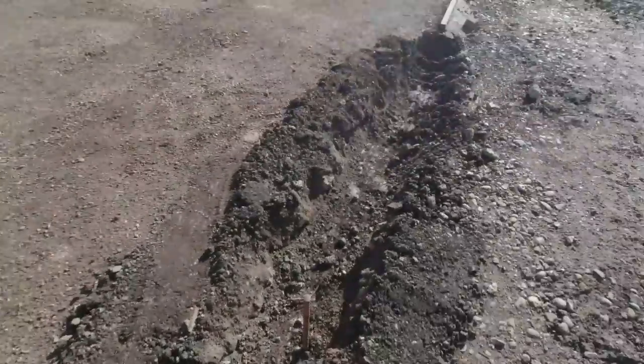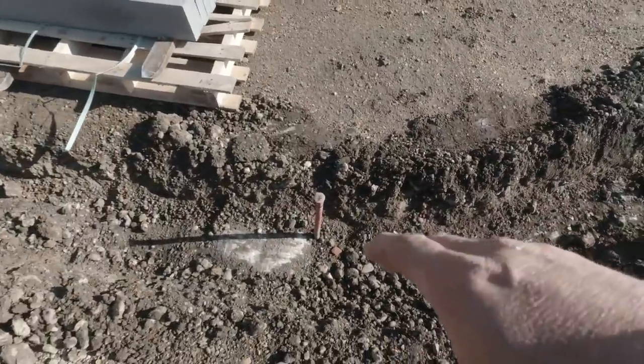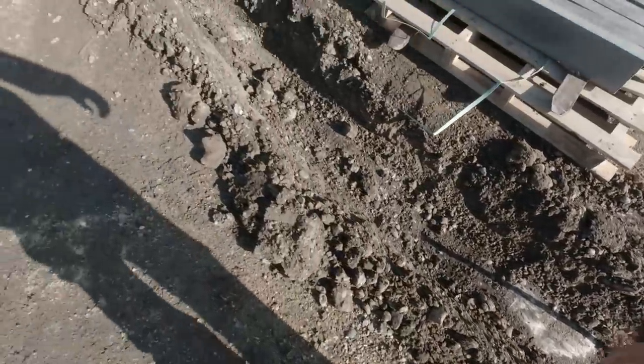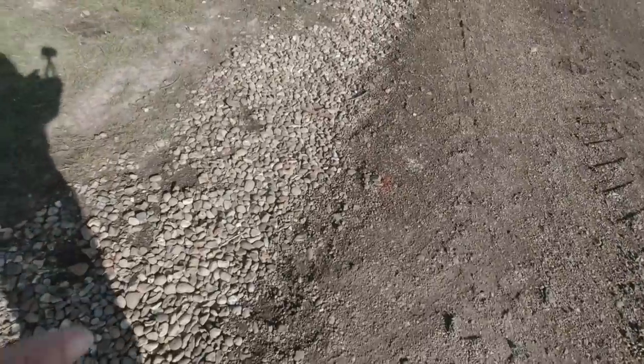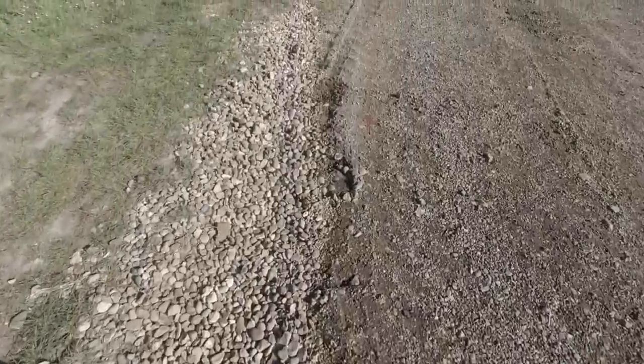There we go. This one comes in straight and in line with the other kerbs. Carry that line on straight to there. Then we brought it out to 5 metres. So it goes from 4 metres, and then through this section here, it actually gains a metre in width. Then we got 5 metres there, 5 metres there, all the way around these red marks we've put. Five, five, five, five. Then we've got a land drain running through here, so we don't want to encroach that. So then we've reduced down to 4.8, 4.6, 4.4, 4.2.